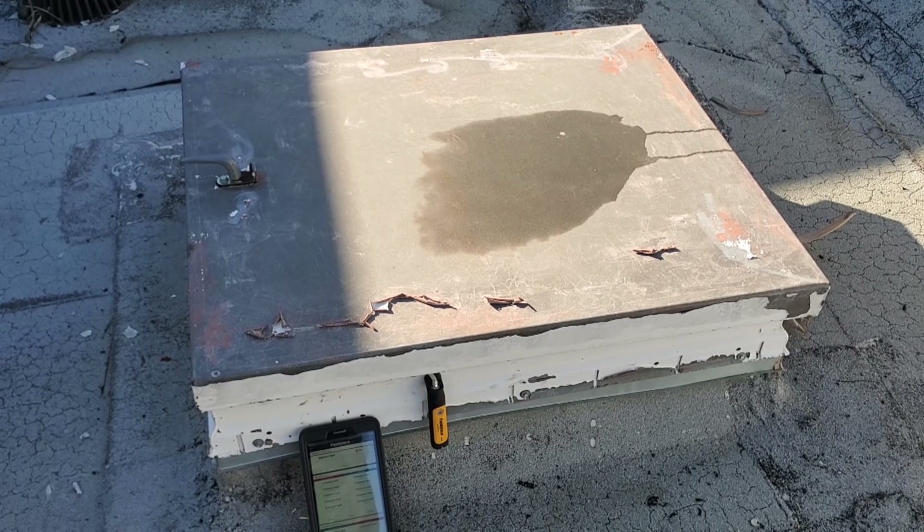One of the burners is fired, one has not. We've got two-stage heat here and they're also very dirty — lots of cobwebs and stuff down in there, so we're definitely going to have to clean that. This one right here is not firing in heat. Let's start by cleaning the unit out, get all the dust out of there, and then evaluate everything. Looks like we also got alarm code 58 — gas valve not energizing. We know that. We're going to clean the unit up first and check the unit belt.